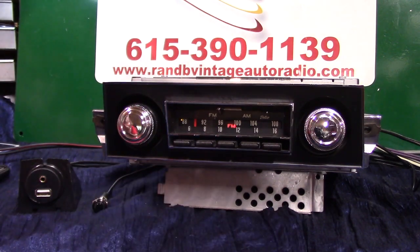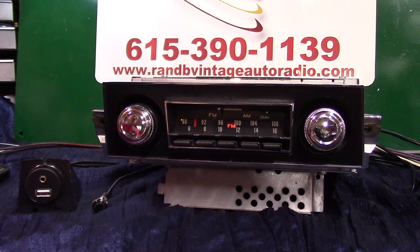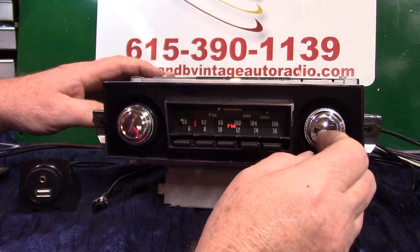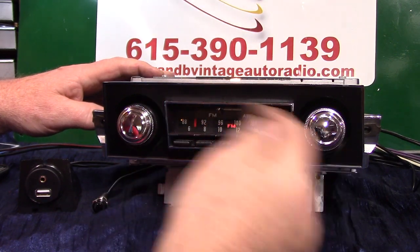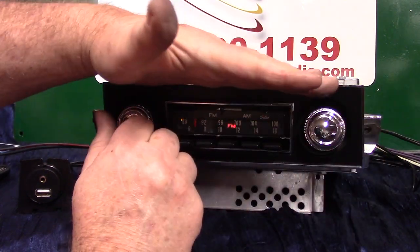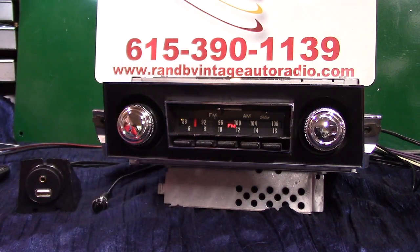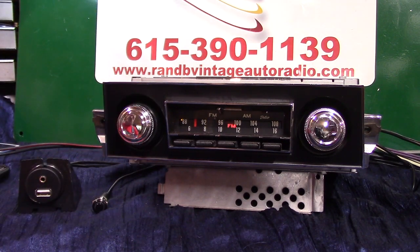Now what we've done, we've done a full Aurora Design conversion on it. We've got the little LED operating way over here out of the way, so you don't even have to worry about that unless you want to look at it. We took the stereo light, because you're running four channels now, and we put it over here so when you're on FM it'll light up when you find a stereo channel. That's the original background light, and that's how you switch from AM to FM — that's what the lights do.